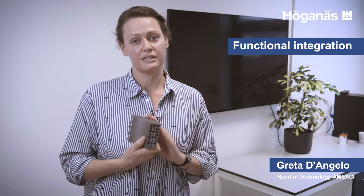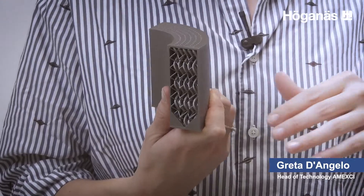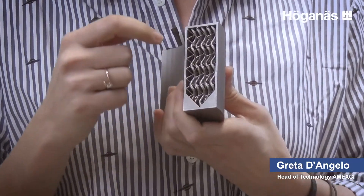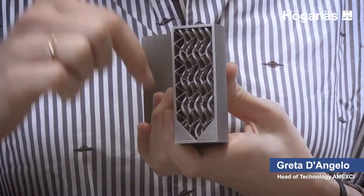I have an example here. This is a heat exchanger and it sits inside of a big engine — try to imagine this as a whole ring. What I want you to notice is these internal channels. There are 600 internal channels inside each of these components. Originally these were soldered one by one, by hand, meaning 1,200 solderings done by one person.